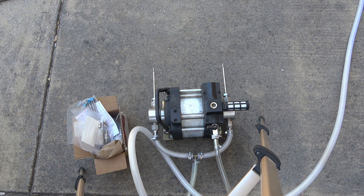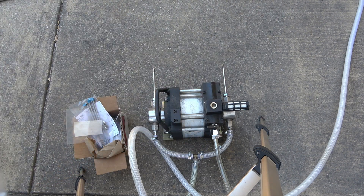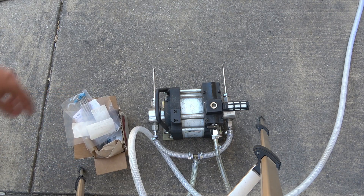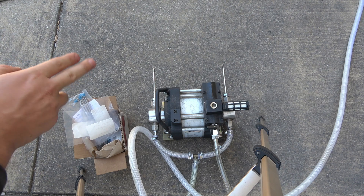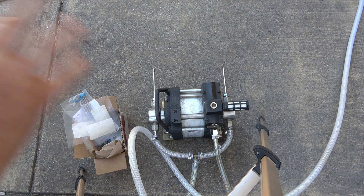I had a steel M14 by 1.5 made because it's very hard to get stainless steel M14 by 1.5 in the United States — the standard for M14 is a 2mm pitch, so 1.5 is a much finer thread. I found steel ones on McMaster, had those machined to replicate the pump fittings, then put in a standard collar. So now I have standard inch fittings attached, and everything after this will be inch. These are quarter-inch OD tubes, and I have two machined nuts there from about a week and a half ago.